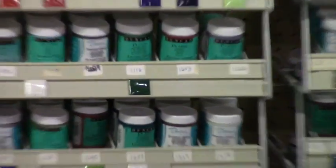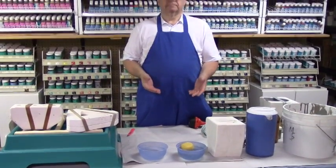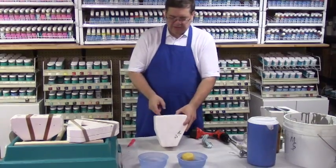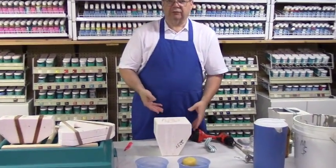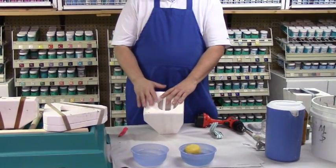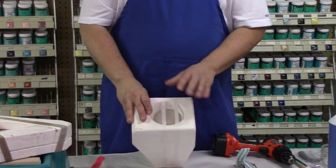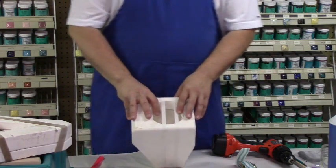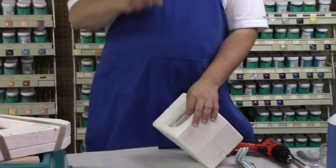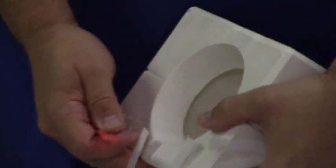Now let me put that aside and go to the next step in the casting process, which is preparing the mold. Molds typically come, when you buy them brand new, with shipping straps — some are plastic, some are black rubber. What you have to do is take these straps off and throw them away, because it's very important you do not use these to cast your piece. These are only for shipping purposes and they're usually not tight enough. They also keep you from doing another very important part of the casting process, which is cleaning out any foreign material out of the mold.